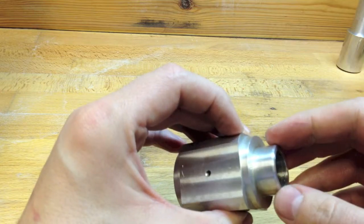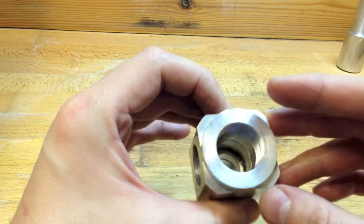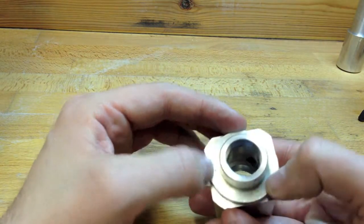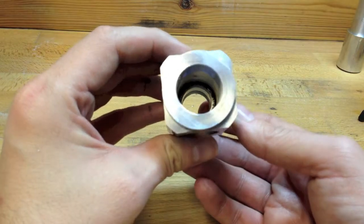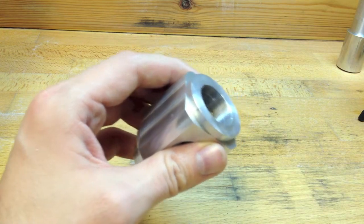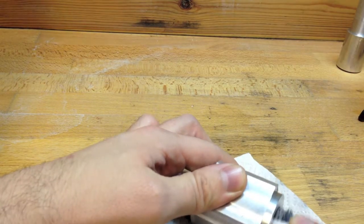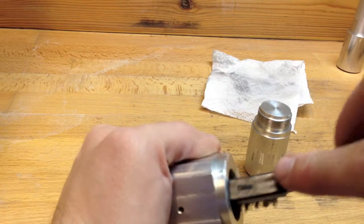I still need to crack the Loctite seal between this nose piece and the body of the microscope before I can proceed. I'm very surprised I wasn't able to get it out previously — I even tried to drive it out through the hole with a wooden punch while the body was resting on this face and the whole thing was really hot, but to no avail. I've been scrubbing this with a bit of xylene. Toothbrushes always come in very handy in the workshop — just to get rid of some of the grease and muck, which I believe may have contributed to the galling inside there.